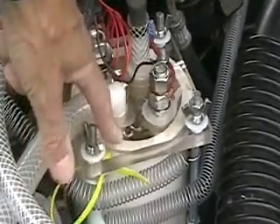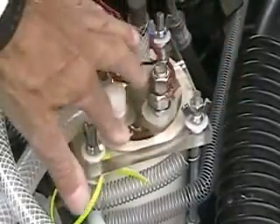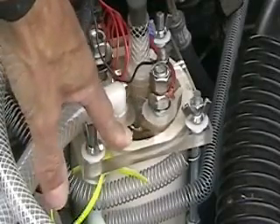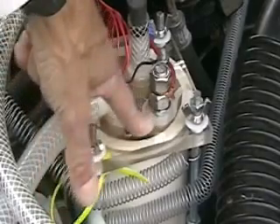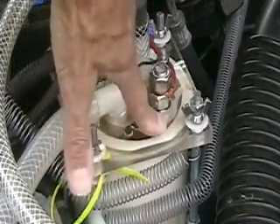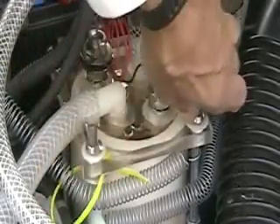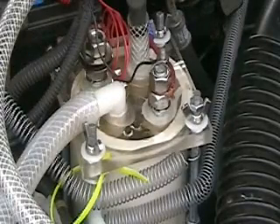I'm having some problems with the tight down here, which I'm going to have to find another type of seal. It's probably going to be a rubber cement-like seal that's removable. The reason is when this heats up, the seal gets more pliable, so these have to be tightened down. That is one of the problems I'm running into.